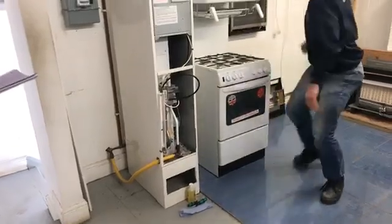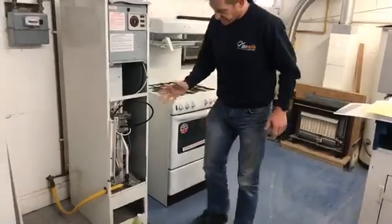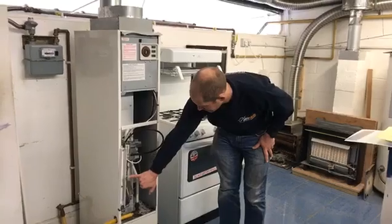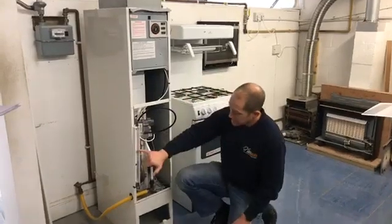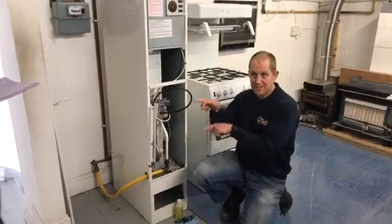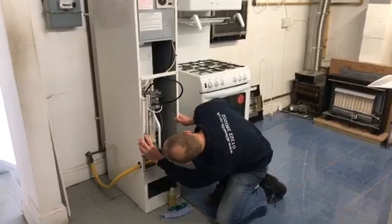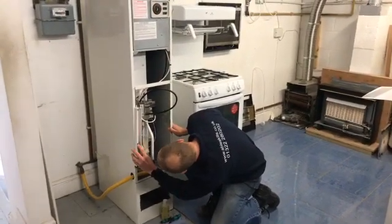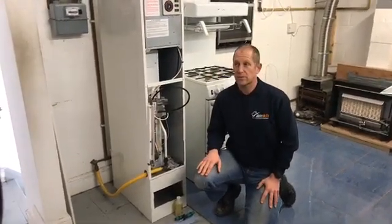Pilot's on. Make sure we've got power. We're going to fire up the burner - we'll hear it fire up and then I'm going to register a pressure. It's fired. We can now see a pressure in the gauge. I'm going to make sure it's reading the same both sides - always make sure. Just over 8 millibars. Now that's not 9.2.